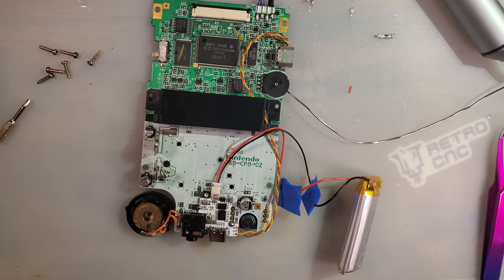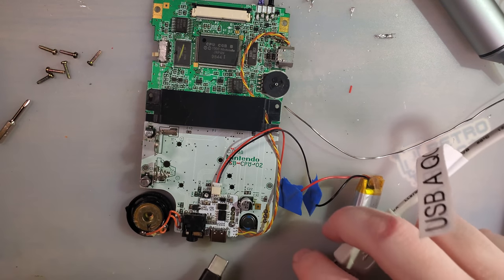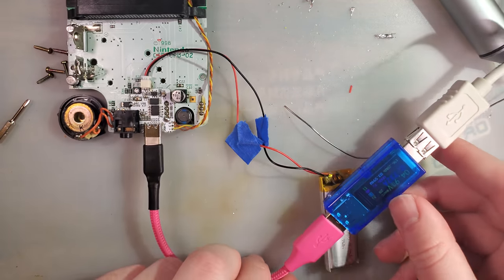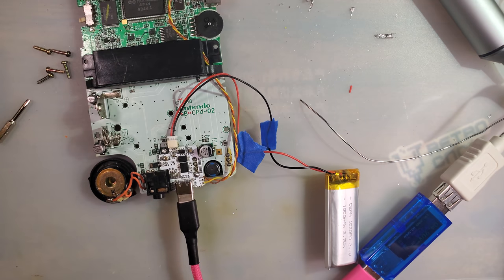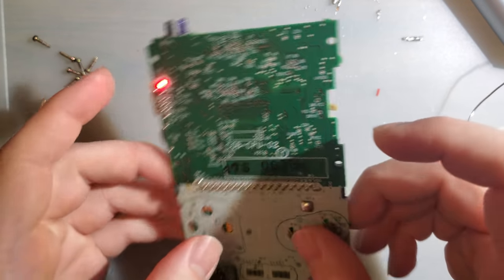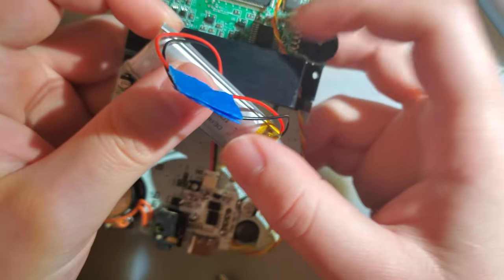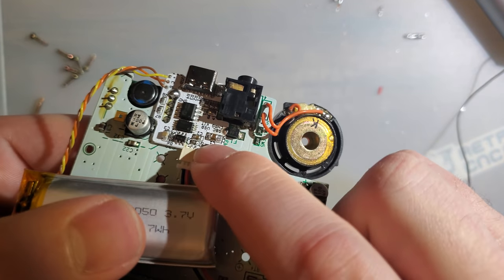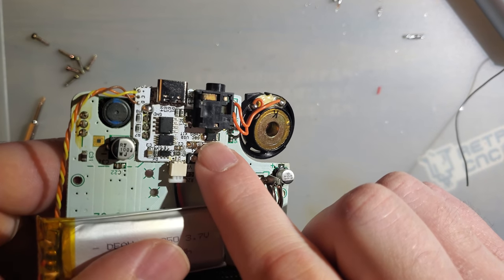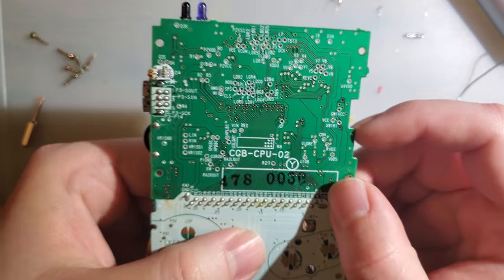Before I even go, let me show you what this thing pulls as far as current goes. It is pulling 733 milliamps. I'm going to let this charge for 10 to 15 minutes, and then we'll come back. So I had quite a few different things going as far as why this wasn't working, but it's working now. First, I re-soldered this capacitor because I think something happened when I soldered it and I was getting continuity on both pads, which is not good. Second, I had to redo the soldering on the fuse because it turns out I just did very poorly the first time around. And now that the battery's actually charged, it turns on. Ta-da!